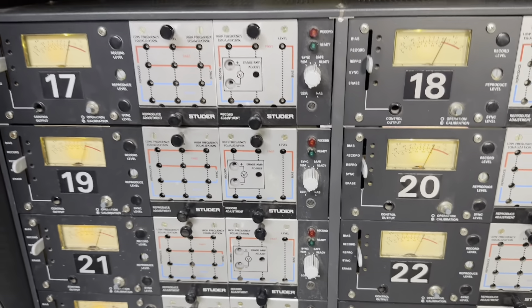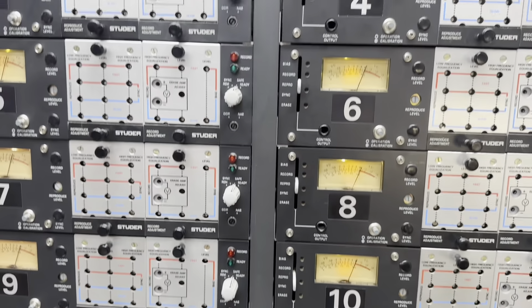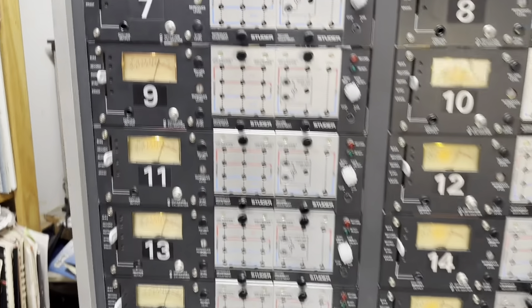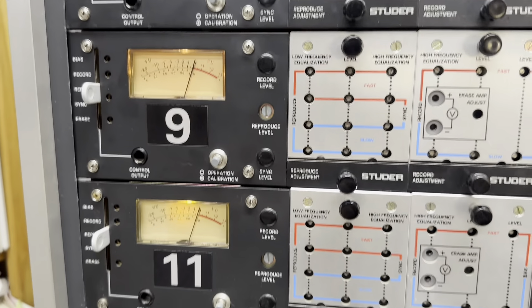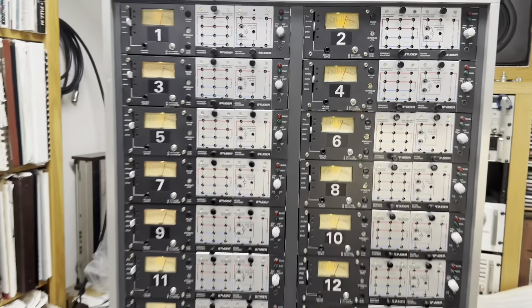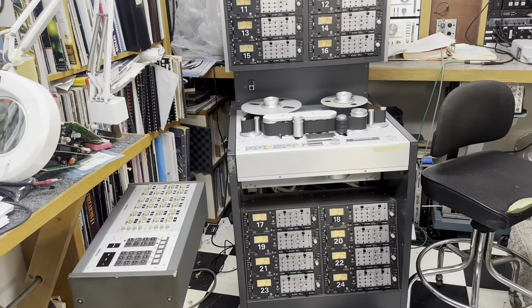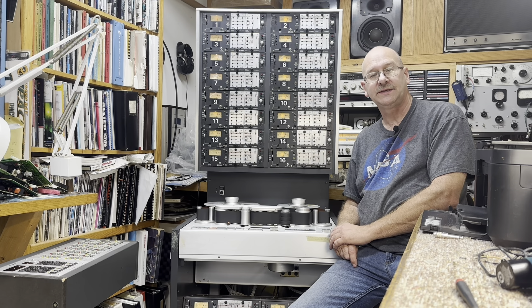Watch how stable all these meters are — about 10kHz now. All the meter lights working, this thing is rock solid, every single amp got her all tuned up. 16kHz — see what I mean? I could tweak it a little bit; I've seen a couple that are low, could just be the heads are dirty. But pretty impressive — all 24 tracks that flat. Going to hook up the auto locator next and align the record section. Don't forget to subscribe and hit the like button, and I'll see you on the next episode.